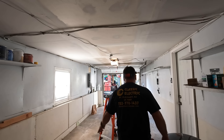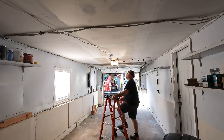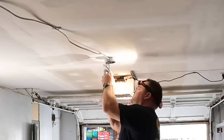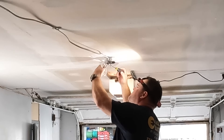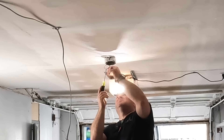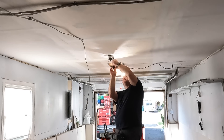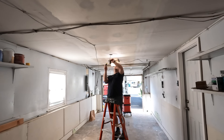Just to get warmed up, the first thing I do is disconnect this old light setup. This is an extension box they used to extend the circuit along the surface. The circuit was actually grounded around the screw — it wasn't proper — so I disconnected it and reattached a new pull chain up there, left it in the on position, and disconnected and got rid of that other conductor going over to the fluorescent light.